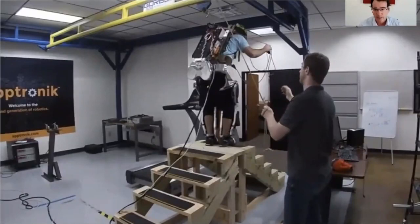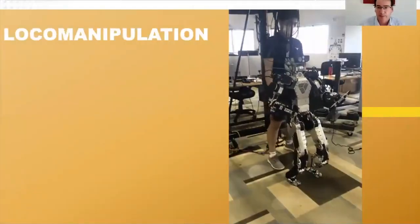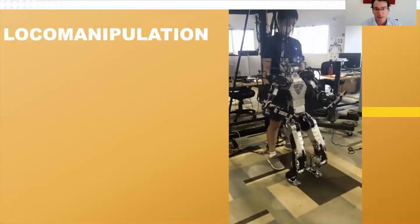Later on, Aptronic went on to design another version of this exoskeleton using much more direct drive and more sophisticated mechanical reduction, which would reduce the weight significantly compared to the previous version. Most recently, we have designed with Aptronic a new humanoid called Draco, focused on legged manipulation — meaning walking and manipulating at the same time. The system was just turned on a couple of weeks ago. The hip and knee flexion-extension use outrunner motors with low gear ratio to improve swing speed.